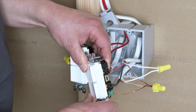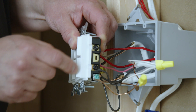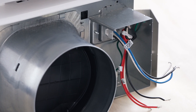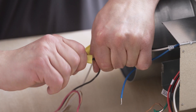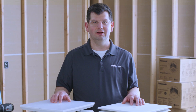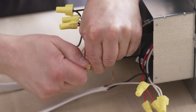The single-pole over single-pole switch on the right controls the light and nightlight operation. The common tab remains in place — do not remove. Bring the power supply from the source to the switch, then bring power up to the fan junction box. Supply power to the black wire labeled light for regular light operation and to the blue wire for nightlight. Connect the neutral white wire to the white lead and the bare ground wire to the green conductor in the fan's junction box.